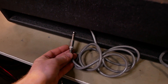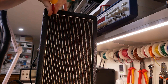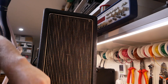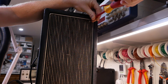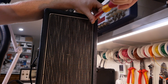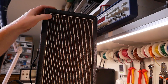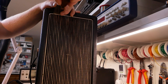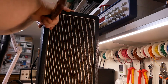We've got a curious combination of flathead and Phillips screws and they appear to be original - it was just in that crossover period where everything was going Phillips and flathead screws were becoming obsolete. You've just got to be really careful undoing them - get the right size screwdriver, don't slip, never use a drill on flathead screws or you'll go wandering across the tolex leaving a trail of destruction. I've got my flat palette knife here to just gently persuade things.